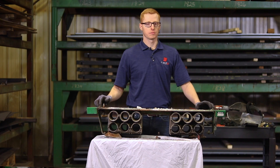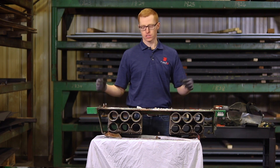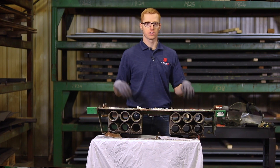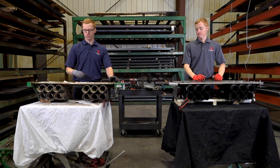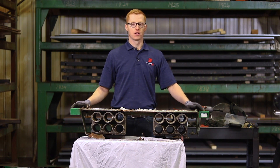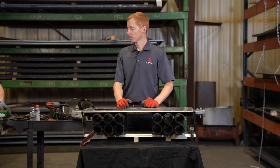This part of the metering system is the lower manifold assembly kit. A common problem with this is extreme corrosion, because this is where all the fertilizer and other corrosive materials come through the meter housing and into the air stream. There are a lot of cavities here that hold that fertilizer and corrosive material, and it just sits on here and rots out the steel and causes all kinds of problems. Another common problem is related to the slide selector, which can become very troublesome over time and requires daily cleaning.